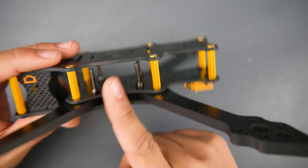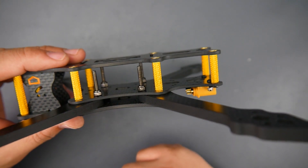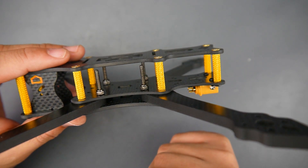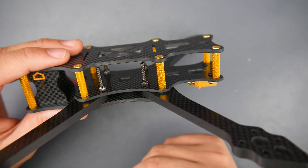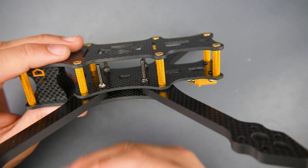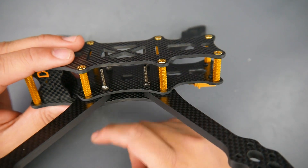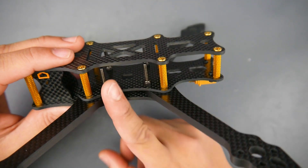For the overall space inside, you get 20mm. However, those nuts right there are going to take away some of the spacing inside, so keep that in mind — probably about 4 to 6mm minimum. You do need these nuts, but this is one of the things I wish was done differently. I wish they had self-locking nuts — that would have been much better in my opinion. It would give you much more space inside, plus they're not as annoying as these to tighten down since you need a plier to hold them in place.